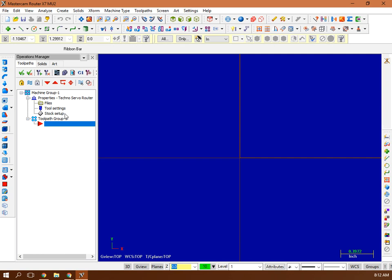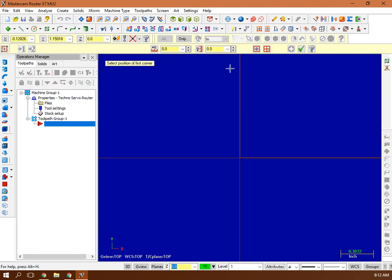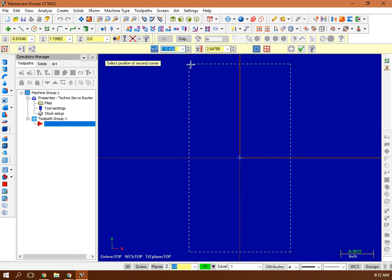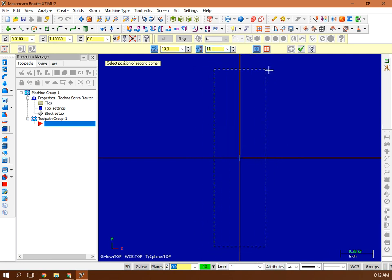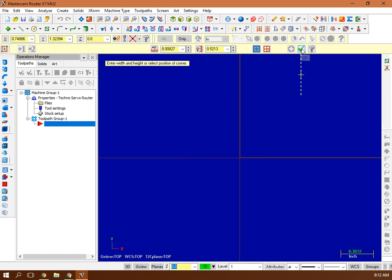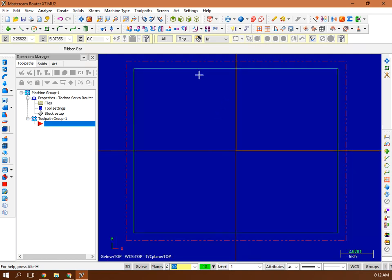I'm going to use a quarter inch ball end mill. Once set up, the next step is to create geometry. Go to the Create tab and create a rectangle. Set it to anchor at center so it starts at the origin. This is the actual board you want to cut out — 13 inches wide by 11 inches tall. Click in the first quadrant, and the green check mark confirms the operation. Fit Screen shows your board is smaller than your block of wood, which is good — you have room to fixture it.